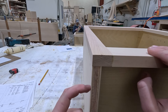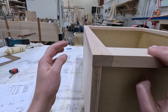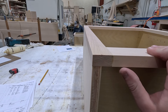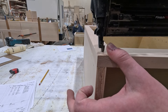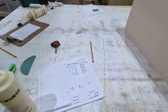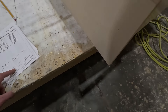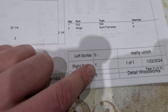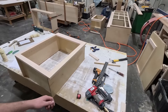If you run the face frame flush with your end panel, you risk burning the veneer, so we run it past and belt sand it down to bring it flush, then finish with a buffer to get out any scratch marks or visual blemishes the belt sander puts in. This correlates to our drawing where the left scribe is zero — finished end — and the right scribe should be one inch. We hold our tape measure and keep it consistent across the whole edge.